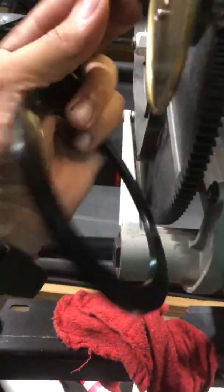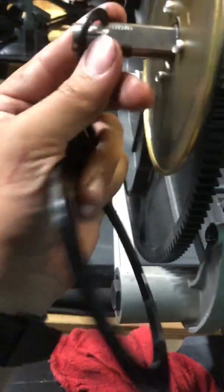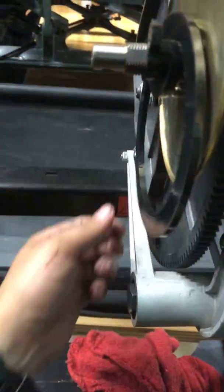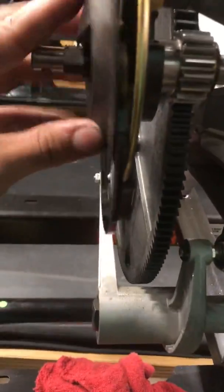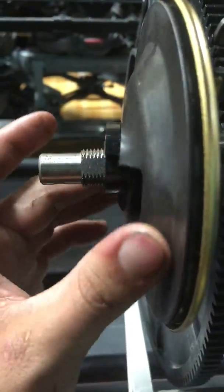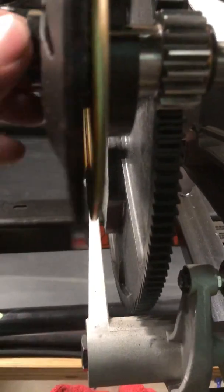So there's homeboy there. And we got the worm gear, and where it says out, ooh, hold your horses there, cowboy. Special washer. There we go. And then where it says out, it's gonna go out. Got a friction disc, and this is in my hand. So this dude turns to the left to tighten up, but we're not gonna tighten it up to the point where the worm comes off and disengages from the back of this rear clutch plate.